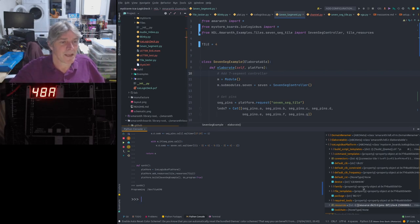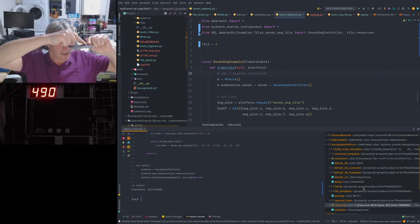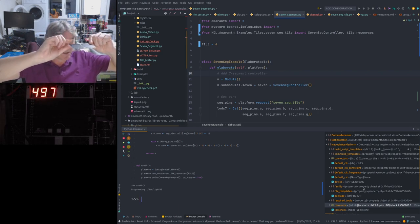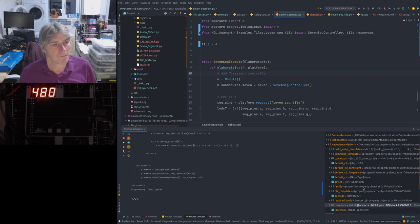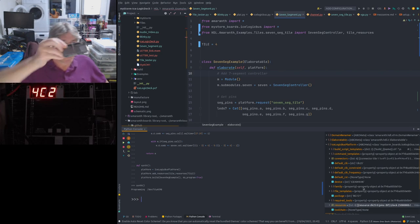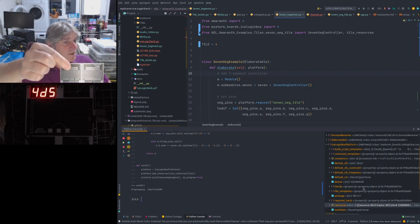Then when I put it in the oven, the connectors will be sandwiched between the two boards, spaced by the spacer, and held together by screws, so that they will not fall off. Bob's your uncle. That should solve the problem. The other advantage of doing this is the alignment should be perfect, or as good as the alignment on one of these, because they should align nicely.